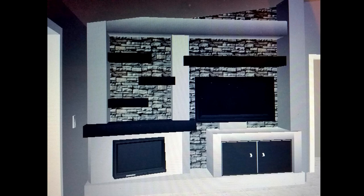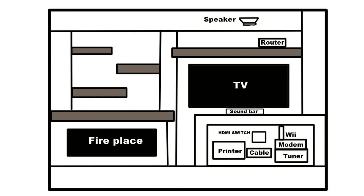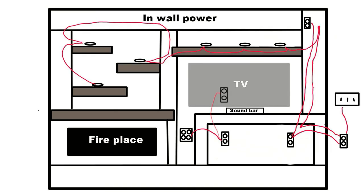The design has the fireplace, the TV, and a cabinet for the equipment. The next step is to get a basic layout of the space with all the equipment in place, then illustrate the wires that will be needed. Start with the power — if you're not comfortable doing this work, have it done by an electrician. I wanted the outlets to fall in the cabinet, so two existing outlets had to be tapped into to supply power to two outlets in the cabinet. The outlet on the far right had its top part controlled by a wall switch, which meant I could control the new shelf lights with that switch. The bottom part of that same outlet also gave power to the cabinet outlet and up high to the router, which was not controlled by the switch. Make sure you run an outlet behind the TV.